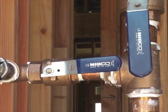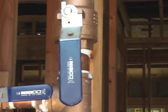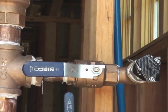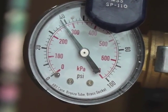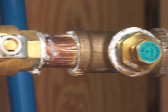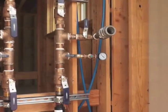A flush port is located on a branch of each T for connecting up the flush cart hoses. Full port brass ball valves are used in the manifold to allow full flow of water without restriction. Pressure gauges should be permanently installed on supply and return piping to allow monitoring of wellfield pressure at any time. A pressure port is provided in the manifold to allow the water pressure to be checked and water to be easily added in the event of a repair.